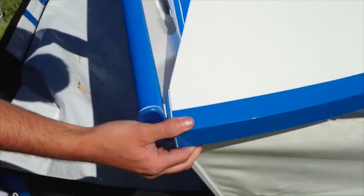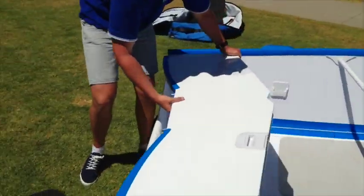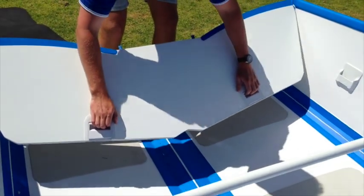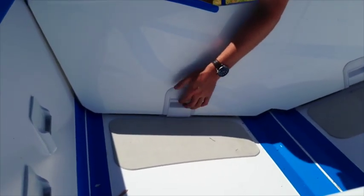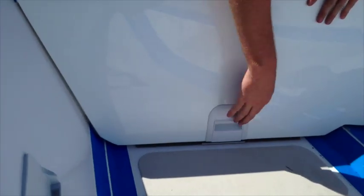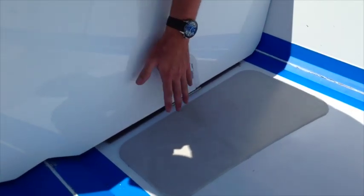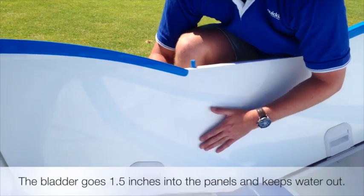That piece goes into place and begins pivoting. On the base we've got stainless steel catches on the floor on both sides — as the transom comes down, they lock into place. There are two parts of the locking mechanism: one on the floor and a smart little latch that makes a good sound when it clips in. That lip goes below the stainless steel catch and is now locked down. The whole back section is now forming one rigid structure for the outboard motor to push the boat forwards.